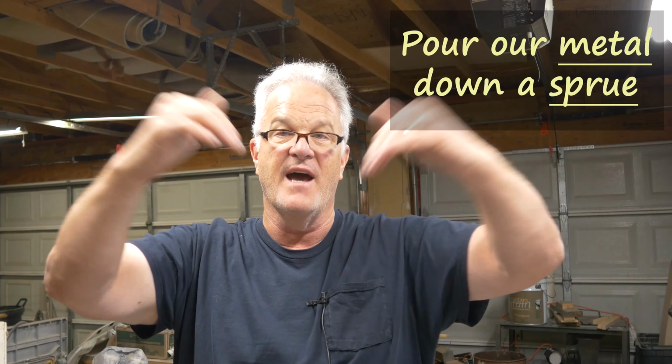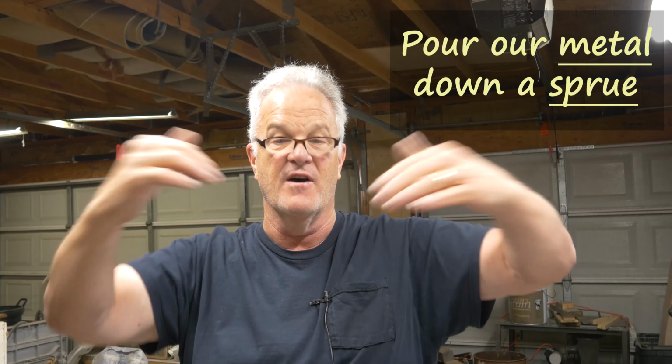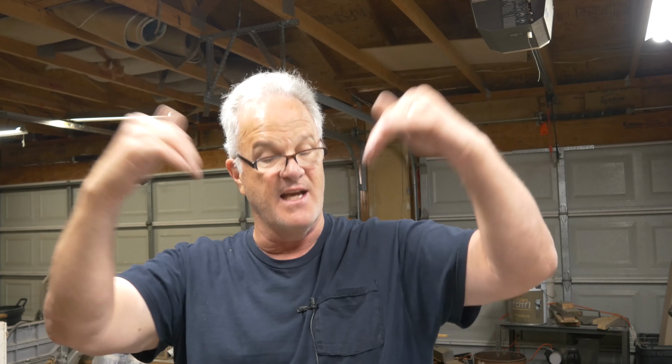You're thinking to yourself, well, what does this have to do with metal? It has everything to do with metal, because when we pour our metal down a sprue that is wide open, what's going to happen? If we pour our metal down a hole that's bigger than the metal can fill, we're going to be sucking air in just like that bag. We're going to suck air down into our castings, and we're going to have porosity in our castings. You can't help it. It's going to happen.